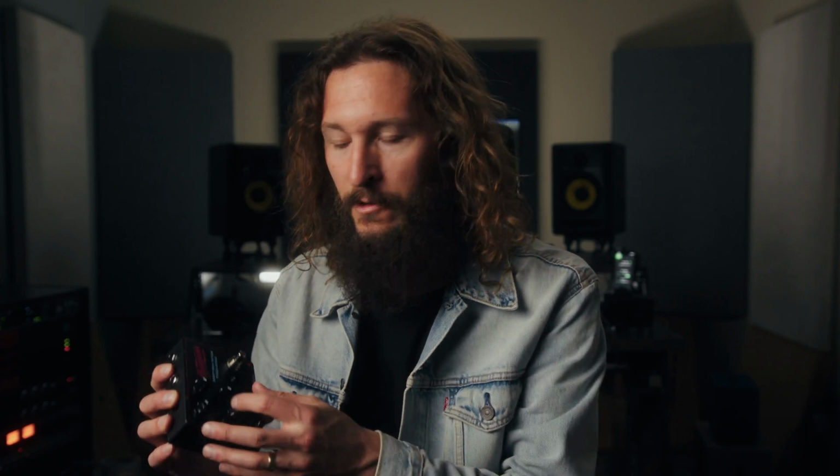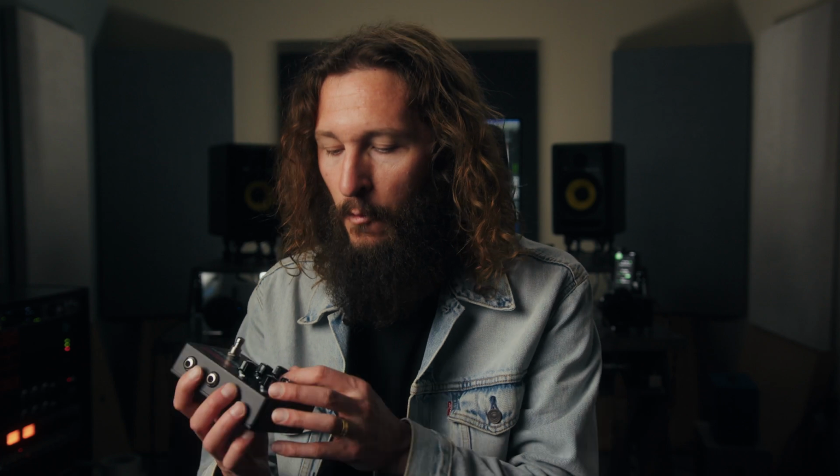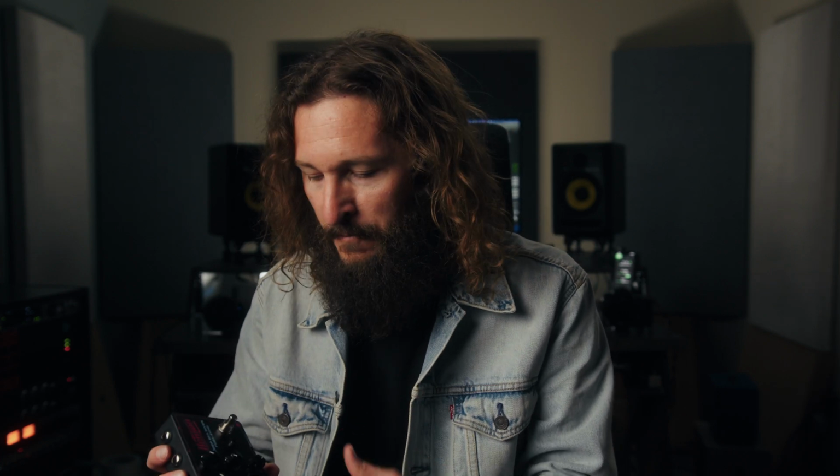And the other half of this pedal is going to be a 3-knob echo. You have your echo mix, your feedback, and your rate. It lives very aggressively in a more slapbacky area for a lot of the twist of the knob, getting up to just shy of a second or so of delay at the most extreme side of things. Never really offering much in the way of white noise or clock noise when you really max it out, because there is no overclocking happening on this particular echo. Because this is a PT2399 based delay, this is going to have similar but not identical flavors to the Benson delay from last year.